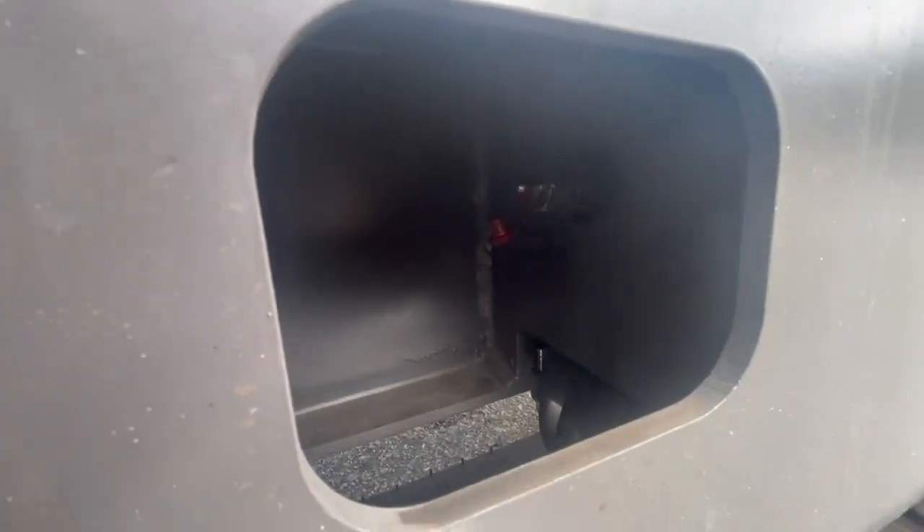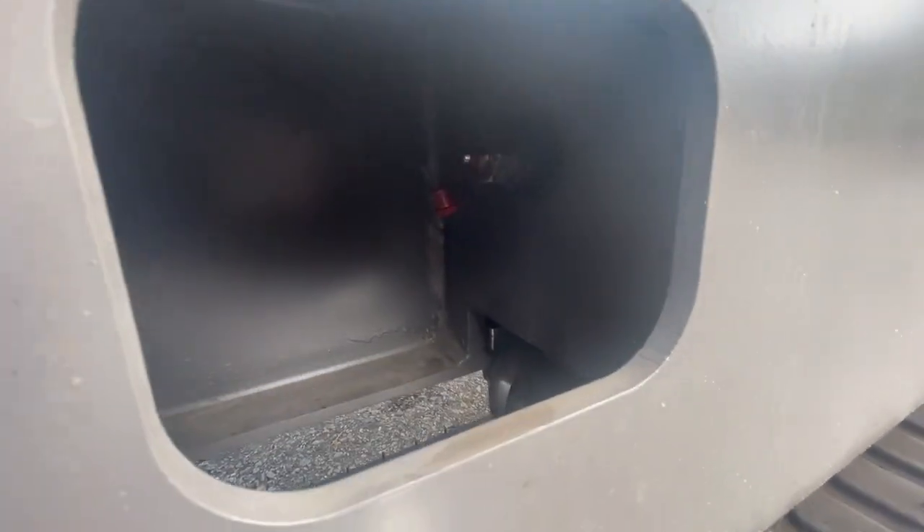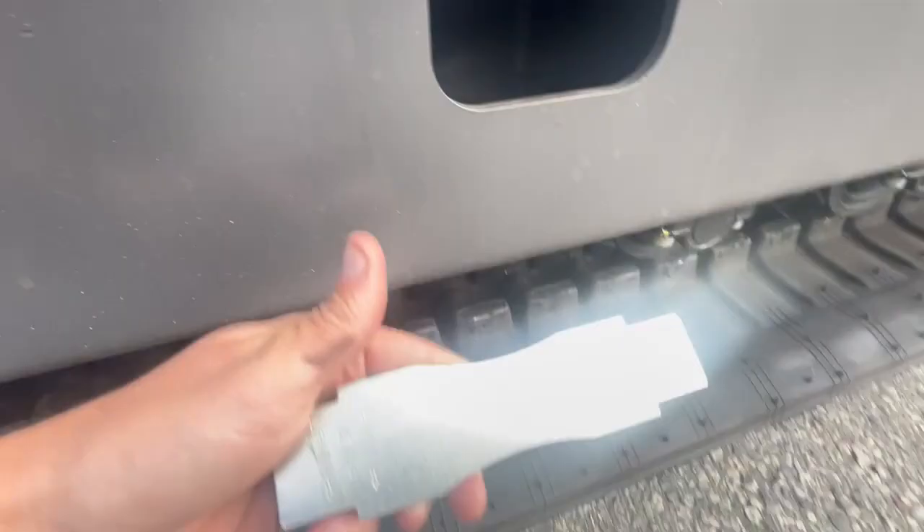To relieve the tension, you need to screw the whole nipple out — not just the little one, but the big hex. There's a spanner in your tool bag for this. Remove the whole nipple and some grease will come out. Push down on the track to release some of the tension, put your nipple back in, and then pump it back up to the correct tension using the gauge.